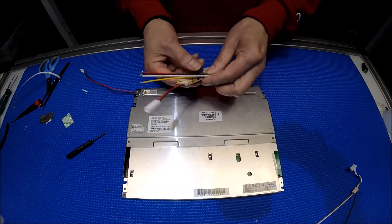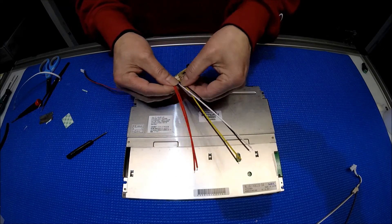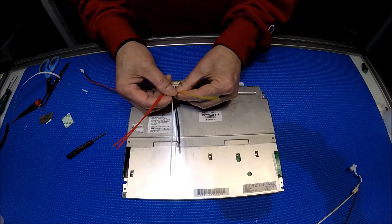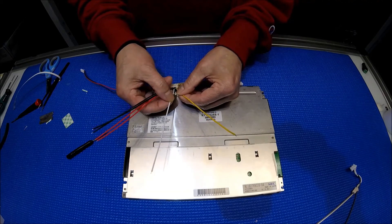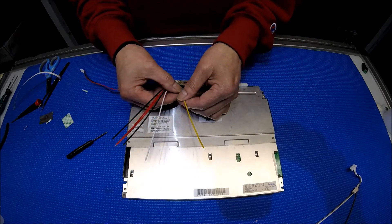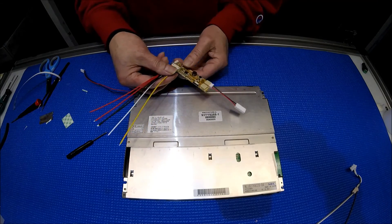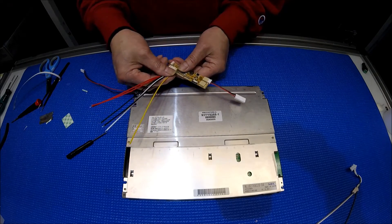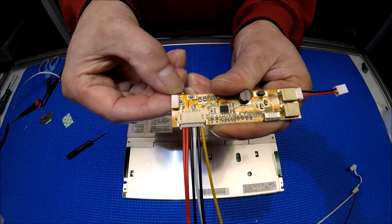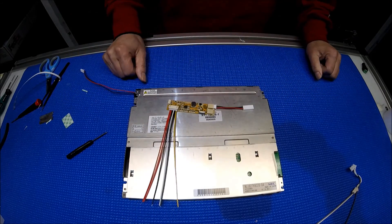For the driver MS601, the red wire is for input voltage — you can apply anywhere between 10 to 24 volts. Black is for ground. White has no connection. Yellow is extremely important — you need to apply anywhere between 3 to 5 volts to turn the driver on and off. If you don't have an enable voltage, what you need to do is jumper on CN1 between VIN and ENA.